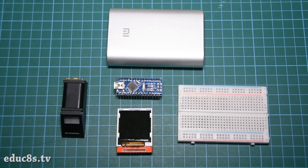The parts needed in order to build this project are these: an Arduino Nano or any other Arduino board, the fingerprint sensor module, a 1.4 inch color TFT display with the ILI9163C driver, a small breadboard and some wires. The cost of this project is around $40. You can find links for all the parts in the description of the video.